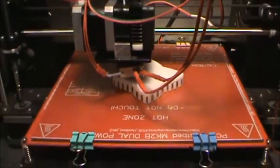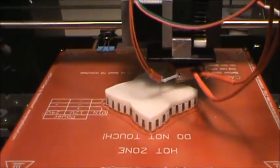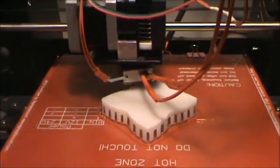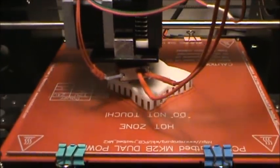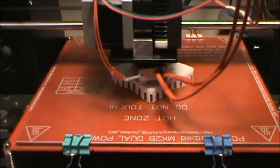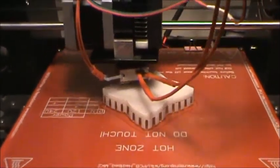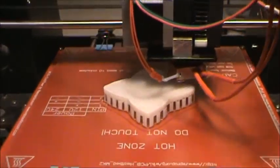One mistake I didn't realize I made during this whole little operation is my printers, once you run them into the slicer program, the Cura program, you have to make the model a little bit bigger, 1.6. So I don't print it 100%, I print it 101.6% to have things come out on size. For what this thing is, I don't think it's going to matter. If it does, I'll make another one.